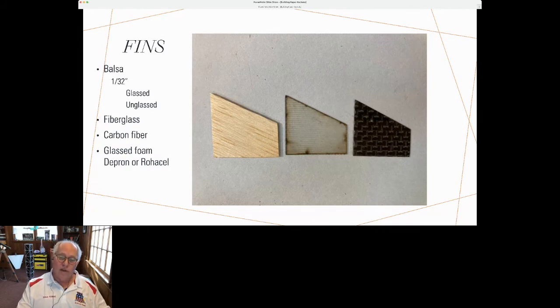So I actually found somebody, Rick Randall of New Way Rockets. He makes the square rockets. His son, Luke, has a CNC machine, and Luke cut these for me. Really, really nicely done. Again, somewhat difficult to do on a CNC machine. You have to cover the entire piece of carbon fiber with tape, because otherwise, as it gets to the last little bit with the router spinning, it flings these across the room. So Luke figured out a way to do it, and he makes absolutely beautiful fins.